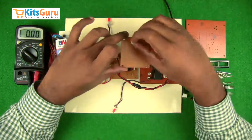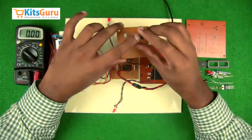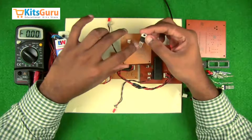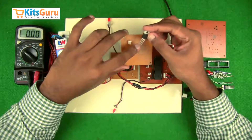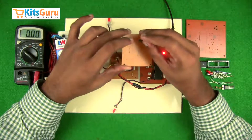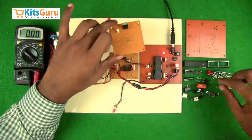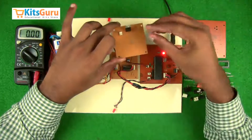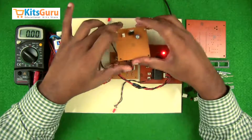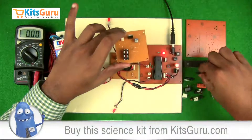Starting with the two-pin connector base for the power supply, then a voltage regulator IC — most components on this kit work on five volts. The left pin is pin 1 (input), then ground, then the third pin is the five-volt output pin. While inserting, ensure you are facing the front face of the voltage regulator IC. A potentiometer is used to set the sensitivity of the sensors. Then this is the LM324 IC base.